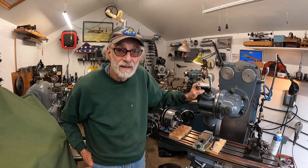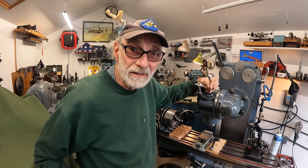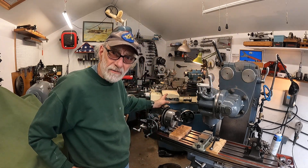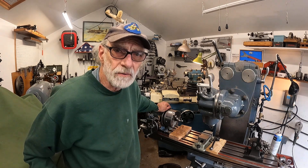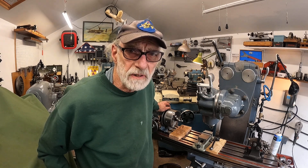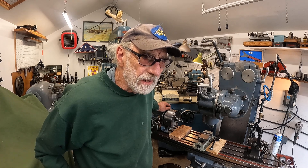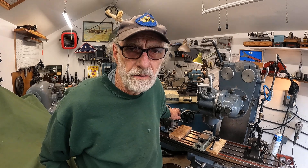I've got four antique machines and this mill is one of them — early 1940s. The cutter grinder I think is 1942. The Morris Speed out there is early 40s also, about 1943 or so. There's an identical one on the battleship New Jersey — that's the Morris Speed drill press. I was looking more closely at that machine and it does indeed have a precision spindle. It's got three ball bearings in the nose and then a Timken Type O at the rear end of the spindle. I guess you'd call it a cartridge spindle, similar to a Bridgeport or the jig borer.